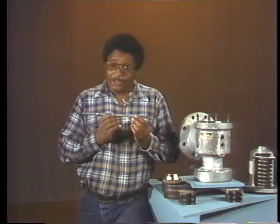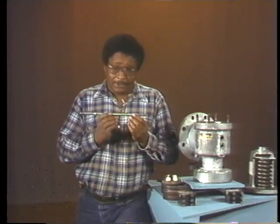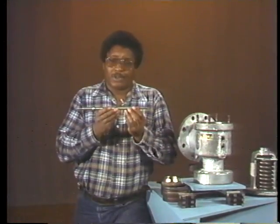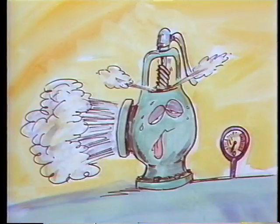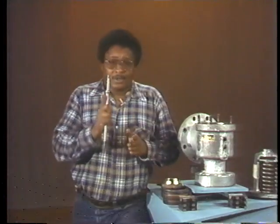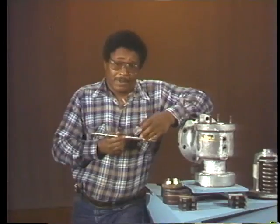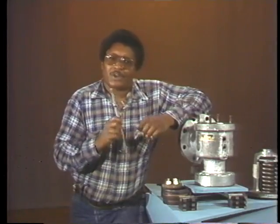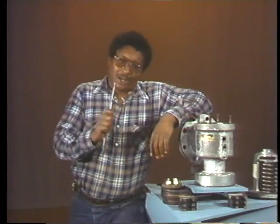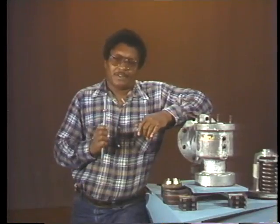That brings us to the spindle. The spindle is among the most critical parts of the valve and also one of the most likely to be damaged. The most common type of damage is bending, caused either by careless handling or by system pressure pushing upward when the valve opens. A bent spindle can lead to a serious valve malfunction — it can prevent the valve from opening or prevent an open valve from reseating when system pressure drops back to normal. Manufacturers establish strict specifications for spindles: depending on size and type, a spindle might be unacceptable if it's bent as little as one and one-half thousandths along its entire length.